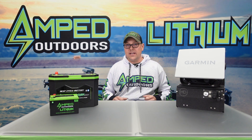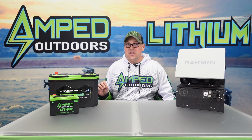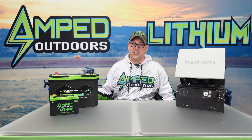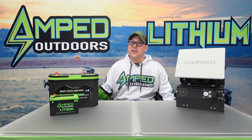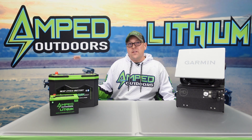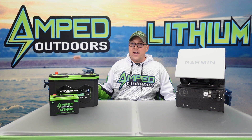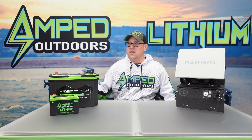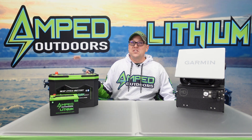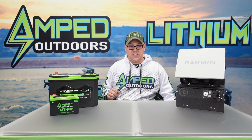The biggest thing when storing a lithium battery is making sure there's nothing attached to it. There is so much parasitic draw on modern day fishing electronics and trolling motors that if you leave a battery connected to your electronics, that parasitic draw will drain the battery down over time. It could be very slow, but over multiple days to months it can impact the capacity within that battery. The worst thing you can do is store a lithium battery long term at a fully depleted discharge state.